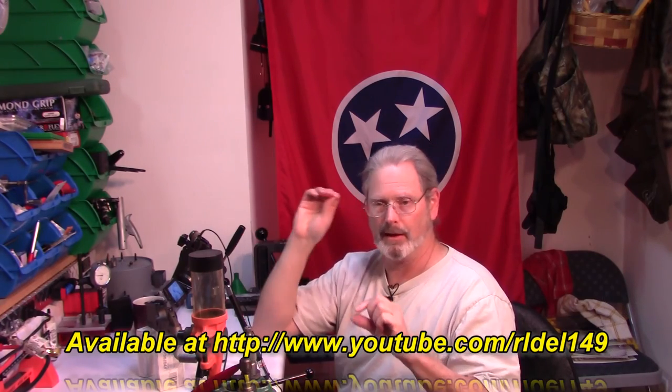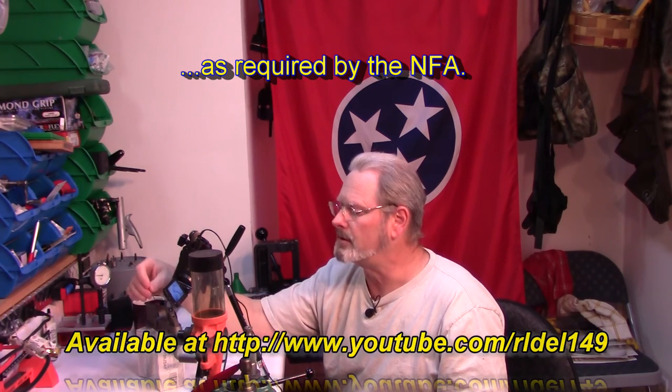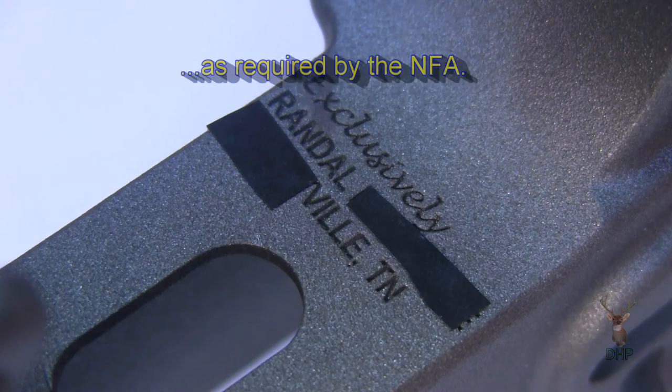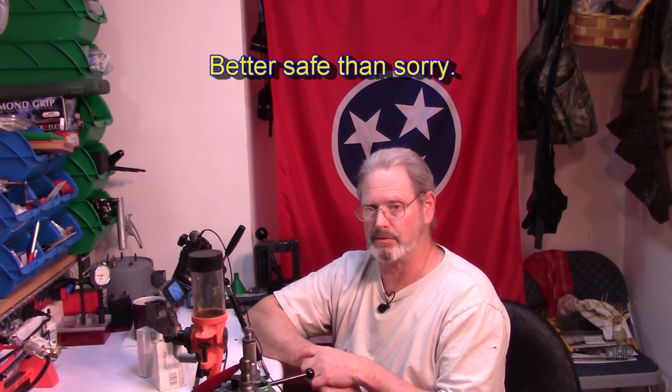The question was whether Philip and Stephanie could lay out my graphics maintaining 1/16th inch character height and three thousandths deep if I arranged it width-wise. That depends on the font and the text itself, how many characters I have. This is my name, my city, and my state — because part of this manufacturing process is that it was manufactured as a firearm. There's a little confusion about ATF industry operations, NFA, what the manual says, what the law says, and what the rules say.